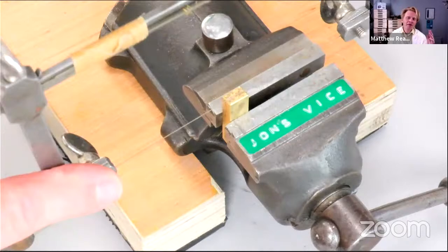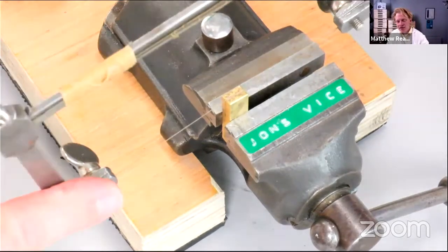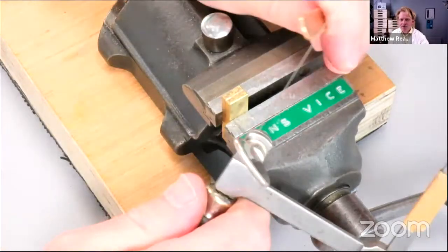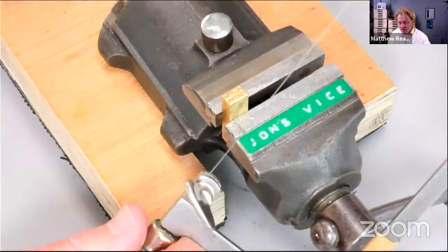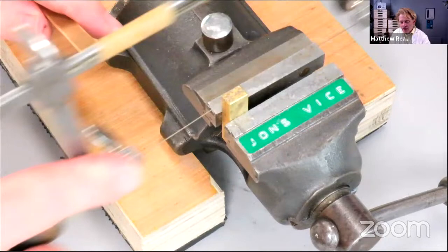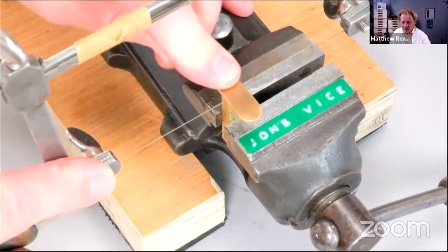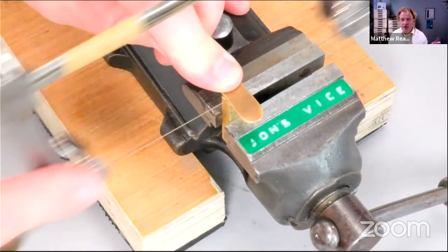Making verge escapements. When you're making pallets of verge escapements, it's useful, if you imagine you're sawing with your piercing saw, obviously in the middle of it, so the blade bends up like that, it's going to be less sawn than the edges. So what you can do like this, you want the thing to saw evenly, deeply, put your tweezers or a bit of brass on there and use that to push down and actually pull up on the blade, and then you'll end up with a nice even depth slot.